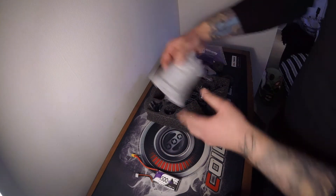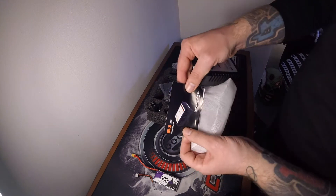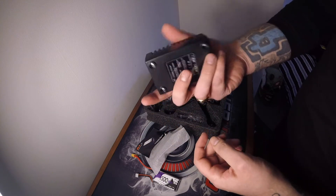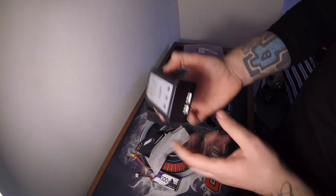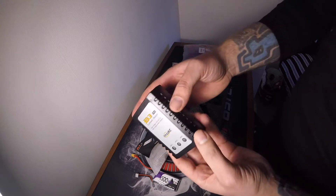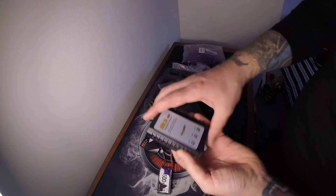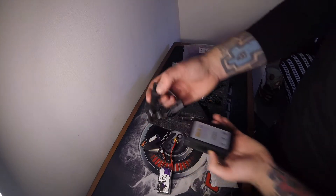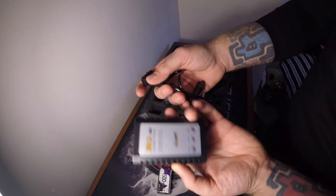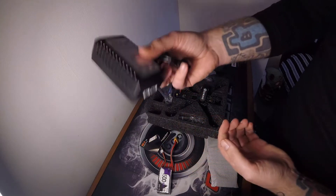Let's look at the charger. Yeah, it's a really cheap charger. I really recommend changing this straight away, especially for 4S, because it's not going to work on 4S — it's only a 2-cell and 3-cell charger. I'm not a big fan of these chargers because I like to put mine into storage mode and it doesn't give you any features. Also the plug is not for the UK, so you'd have to get a converter. But if you've got another LiPo charger, then happy days.